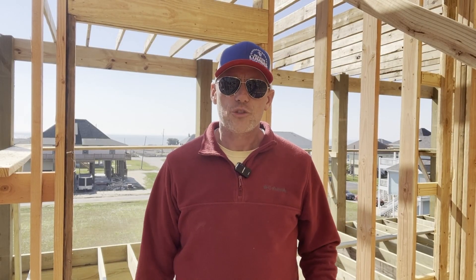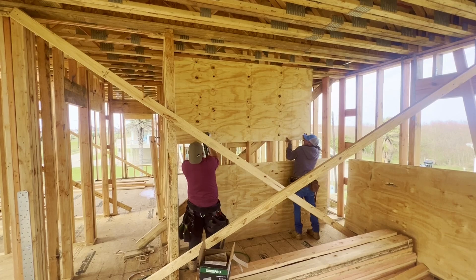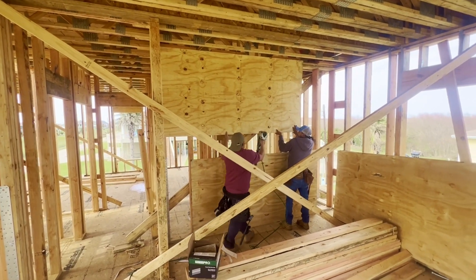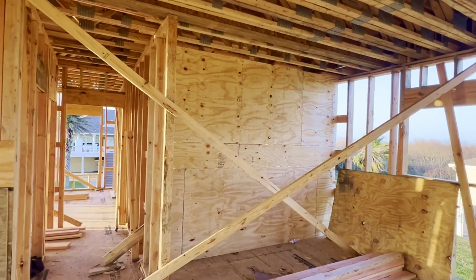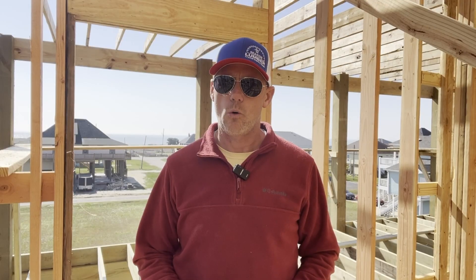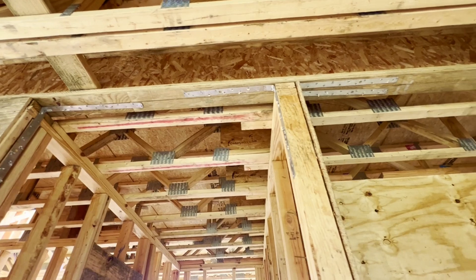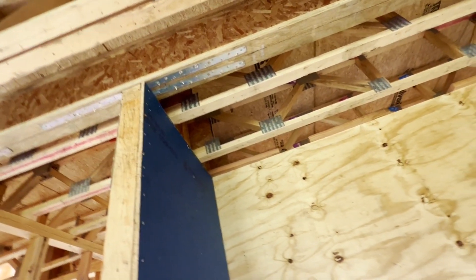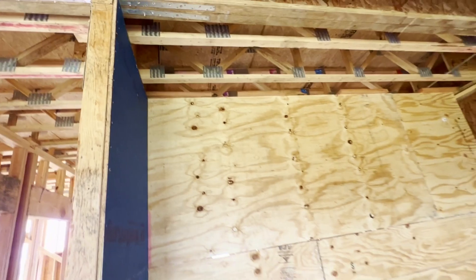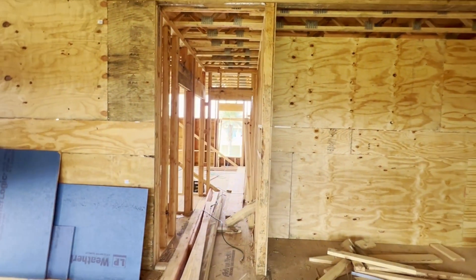On the inside of the house where we put those four tall 66-inch straps, we are also going to put plywood over that entire wall — that is called a shear wall. We then attach LSTA straps from our wall across our truss, which transfers the wind load from one shear wall to the other. This is called a drag strut.